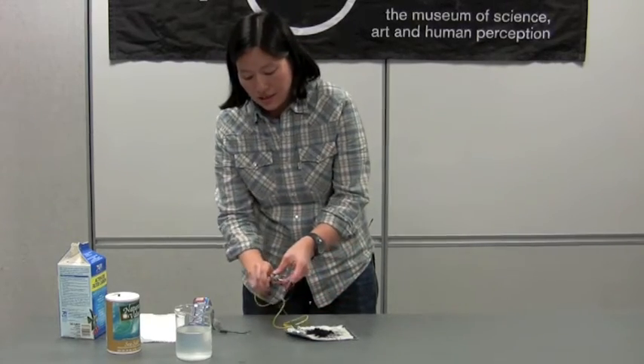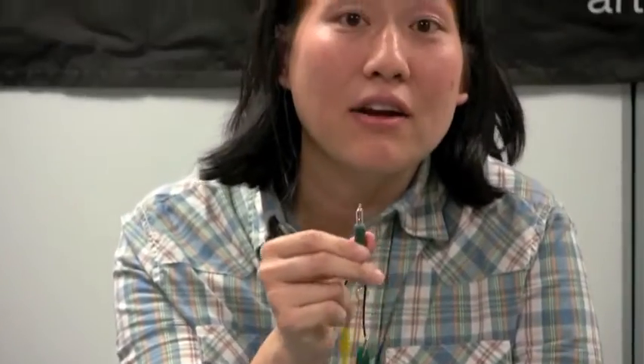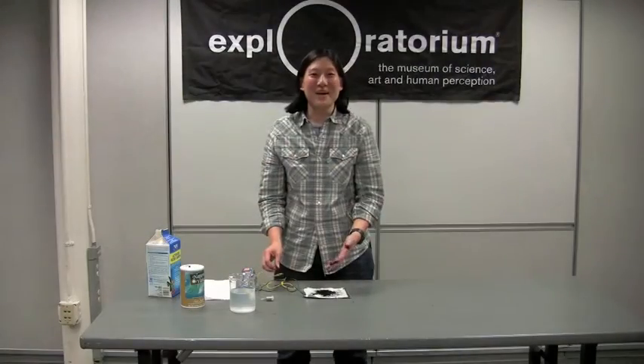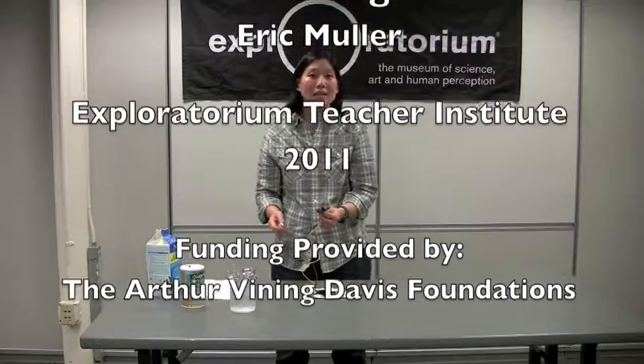I can try another device. I have a holiday light, and these usually take a good amount of current to get going because the bulbs are incandescent. So I'll attach it in the same way. As I press down on the charcoal, you'll see that the light comes on. Let's turn the lights down and see how it looks. This battery generates about 1 volt and 100 milliamps, which is enough power to run a small hobby motor or a holiday light.